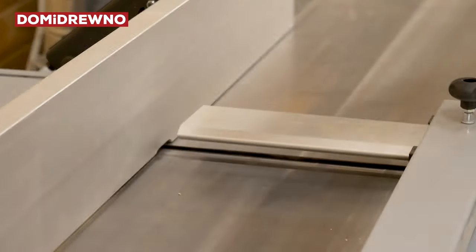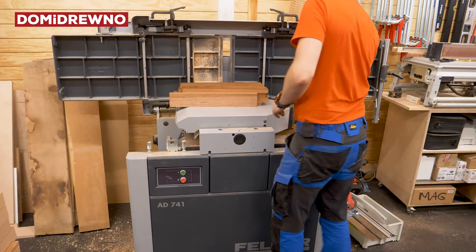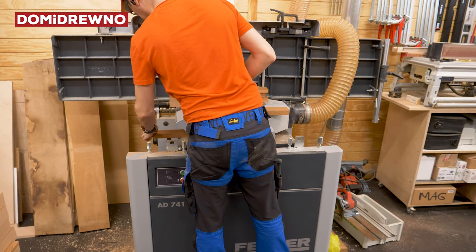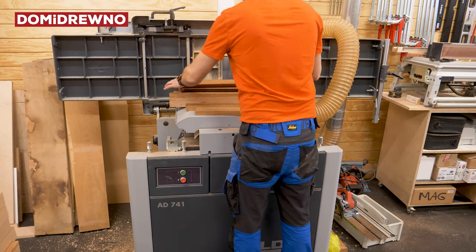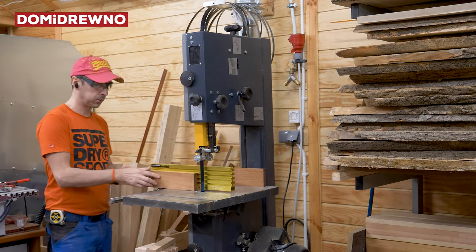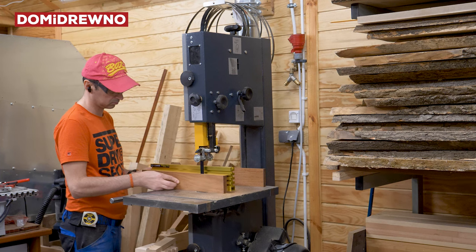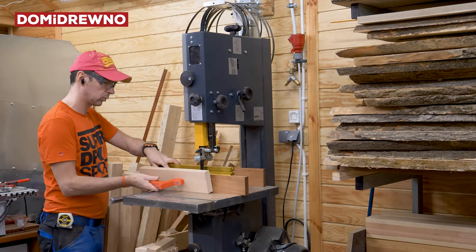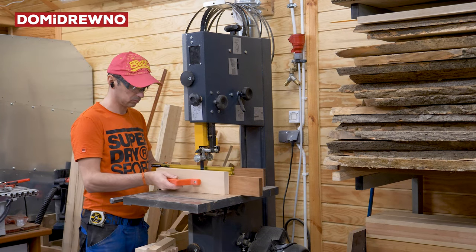And now is another piece of wood. I'm not sure exactly what kind of species it is, but it's exotic and it's very hard. I decided to use this species for the stop block. And now the thicknesser. I decided to cut it on the band saw because the thickness was about 25 millimeters and I need just about 10.